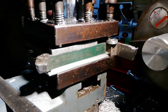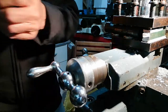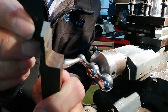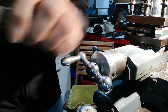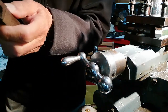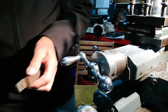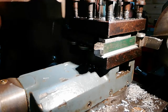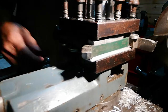I'll show you better with this other tool here. You need to look at the side clearance angle on one side, and the side clearance on the other side. If they're not clear, what happens is the tool tends to get jammed in the groove — and that's where the problem can come from. So I'm going to take the tool out now and make some adjustments.